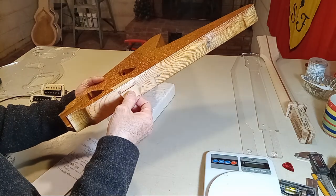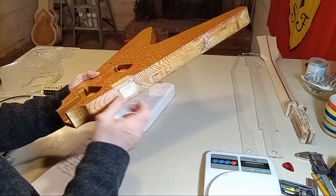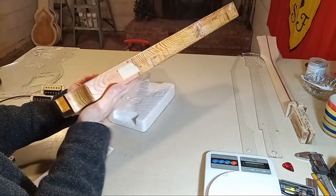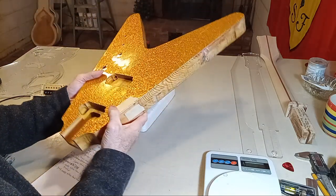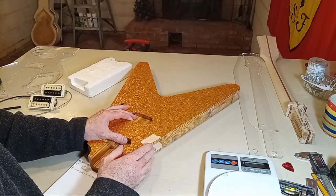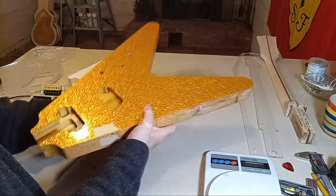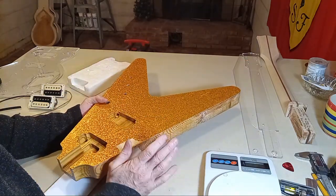If you're not careful, you can wipe this material one or two times with a cloth saturated with a little lacquer thinner, but don't think you can do it five or six times — you'll wipe the color off and realize the aluminum sparkle underneath is just silver, and you'll have lost your gold or red or purple. So protect it with tape. Same thing on the body — once routed and taped, do your binding, then paper off the back as well to be safe.